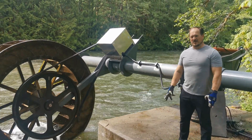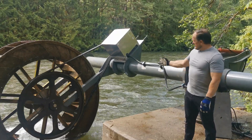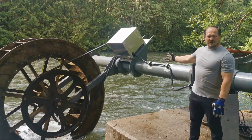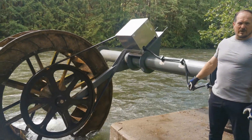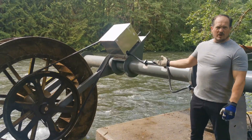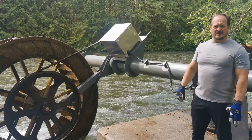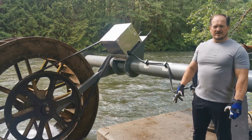It's been two years since we installed the Lignum Vitae bearing. These V-belts are occasionally slipping. The river has come up quite a bit now that all the snow is melting in the mountains. We're going to lift the water wheel up, have a look at the bearings, tighten the V-belts, and see how things look.